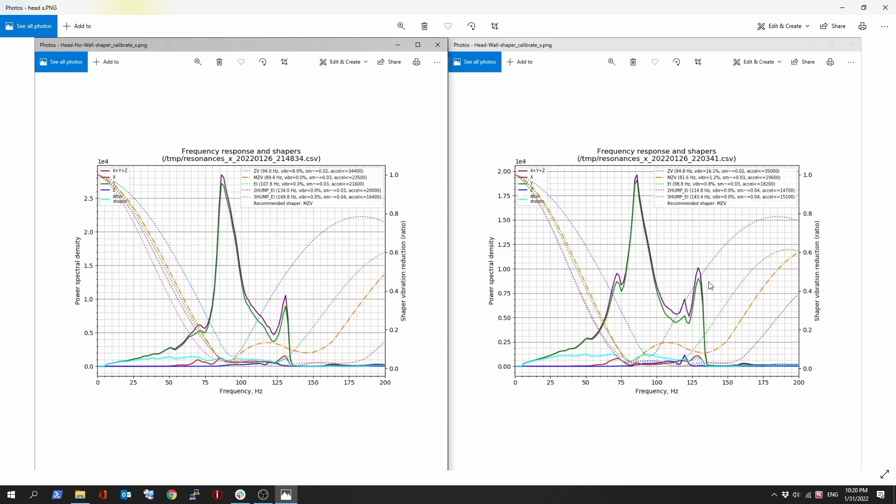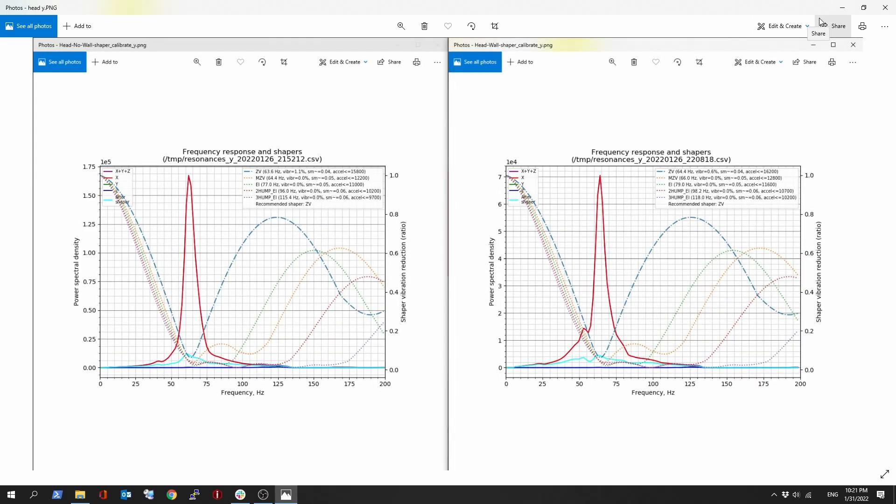But let's take a look again at the scale. We're hitting around 0.9 on the green one. Same thing goes on the left side — a little under 1 and a little above 1 for the other color — which means this part didn't help. That's another resonance that I can't fix. I don't know what that is, but it's happening since I switched the belt to another vendor. I was using Genuine Gates before; now I'm using what I think are called RuthX or something — the brand is Bigtree Tech.